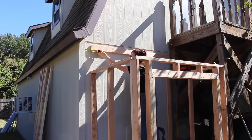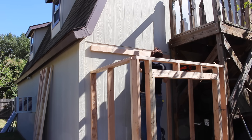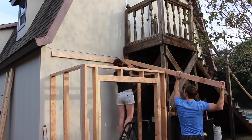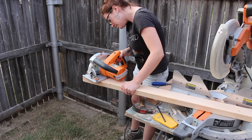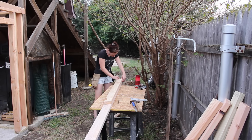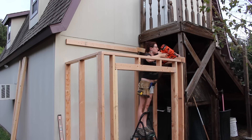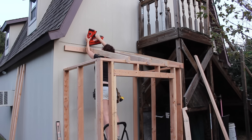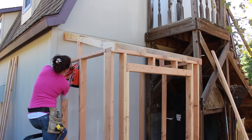Next was to start framing out the roof. I cut a 2x4 to length and then nailed it in place, making sure that it lined up with both of the outside walls and that it was level. I also made sure that I was nailing it to the studs. I know that there are formulas on how to figure out your pitch and your angles, but I just cheated and held my board in place and traced out the angles, so that I was able to come back with my circular saw and just cut along my lines. Once I had the first one cut, I used it to trace out all of the others I'd need. I set them in place and started toenailing them — three nails in the front and two attaching it to the back. The next day, I added two cripple studs on either side just to give some more support.